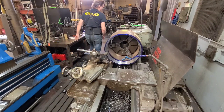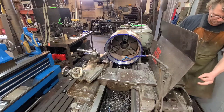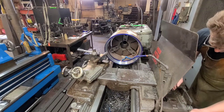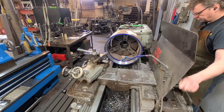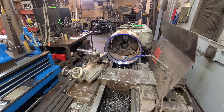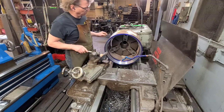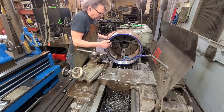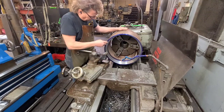I'll walk around here so you can see it in the broad corner. Down here there's a slide and you move that slide over — in this case I moved it to 10 degrees, bolted it down. There's the shoe; you tighten the shoe which engages the slide, and it allows you to power feed on an angle cut rather than compound cross-sliding the whole thing out. So yesterday I blued it up to my depth and roughed it out at 10 degrees until I hit my back depth, and then the 15 degrees is just going to come off the front of it.